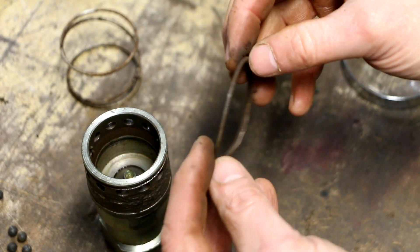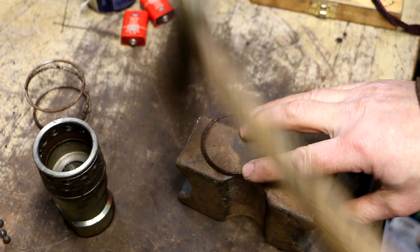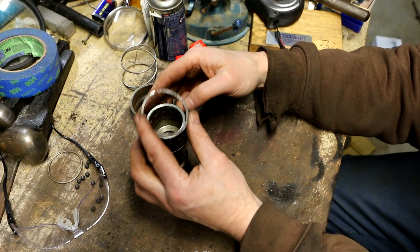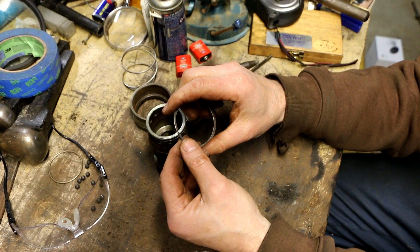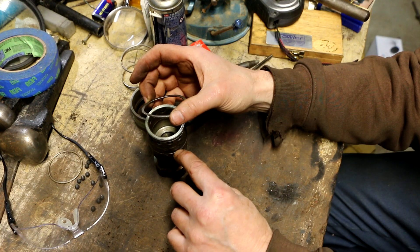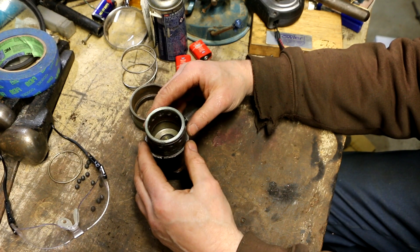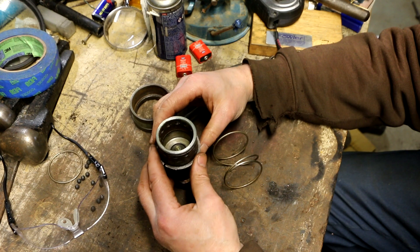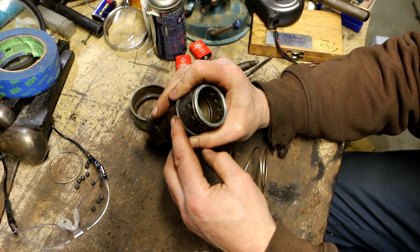The next thing I need to do is clean up the spring and fix up this washer — you can see it's all kind of bent up, I need to straighten that out. This ring ended up getting too stretched out, so it wasn't going to work. What I did was take a cutoff wheel and cut a slot in it right here. Now if I bring the two ends back together, that closes the ring down tight enough so it will not be able to pass this lip right here, which was the problem. But I need to be able to put this back together, and if I just leave that slot in there, the spring is just going to push right past it, so I need to rejoin those two ends.